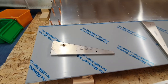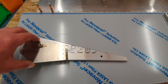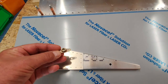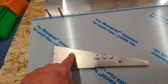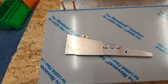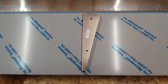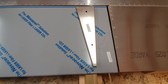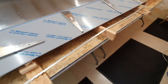On top of these we've got the drive rib - that's three parts: there's the actual rib itself, then the drive plate which is a reinforcing plate, and then we've got a captive nut which is going to be on the other side of that hole there, and that's for the flap drive to attach to. Then we've got two intermediary ribs, the end rib, and then the hinge. That's pretty much everything we've got to do.